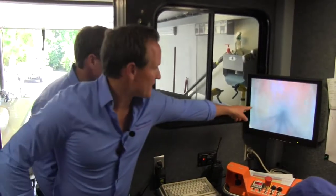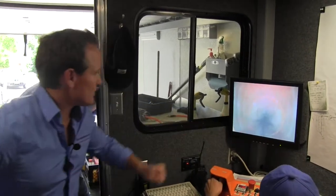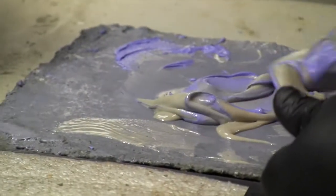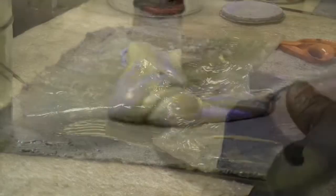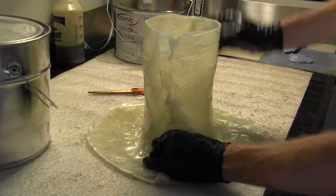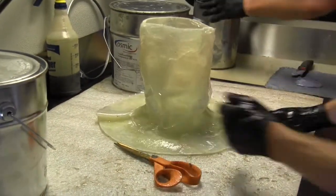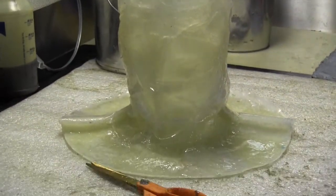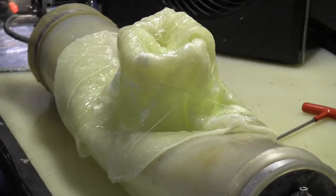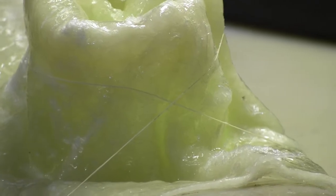It's amazing how modern technology has advanced over the years. Thanks to modern technology, we can now make repairs in your sewer line without the need for costly excavation — this process helps save you money. The resin we use is a glass fiber laminate, also used in the aviation industry, with an expected life expectancy between 50 and 60 years. The material is structurally self-supporting, and the epoxy resin ensures a durable, tried and tested bond to the existing pipe liner. This creates a tight waterproof repair that's durable enough to not allow for root infiltration. This system is approved and certified, and is a market leader in the United States, with more than 30,000 known successful repairs made with this top hat system.